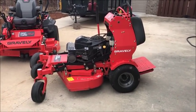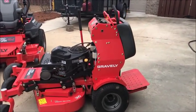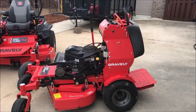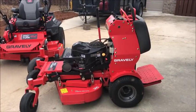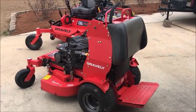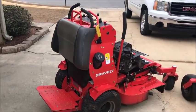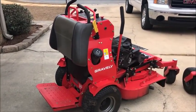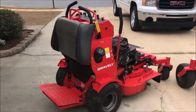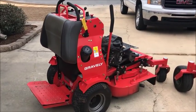The main thing to remember about standers is that they are more compact with a shorter wheelbase. You can get them into tighter spots, and when you're backing up, you don't have a big engine on the back like a sit-down that you feel might smash into a house or a gate. I feel more confident getting this mower into tighter spots. Secondly, the workflow of standers — getting on and off super quick, undoing gate latches and getting back on. You're not getting up out of a seat, stepping on the deck, undoing the gate, then getting yourself locked back in. On residential properties, you're doing a lot of that type of stuff, which is why a stander is the way to go for small residential homes.